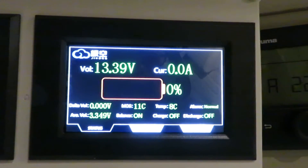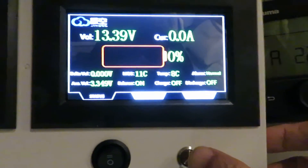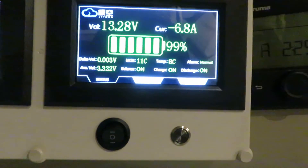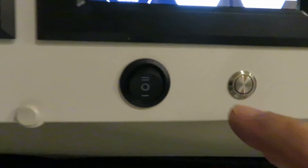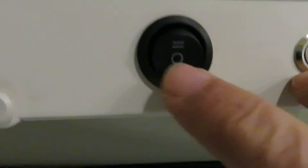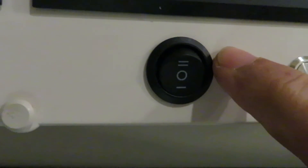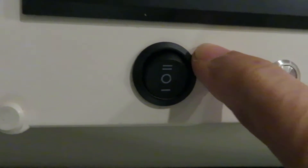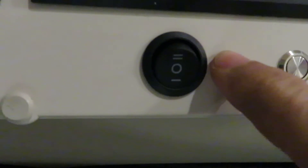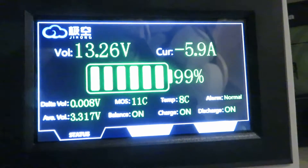This is the JaycoTrak 200 amp hour again. To turn it off, push and hold for five seconds and release — it will turn off. The heater control has three settings: zero is off, one is automatic, and two is force the heater on. So you have manual on/off and automatic on/off based on cell temperature.